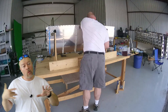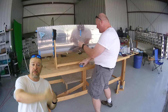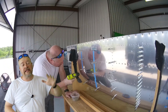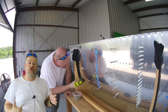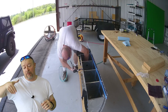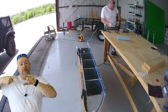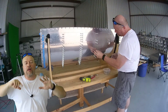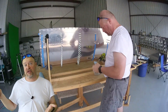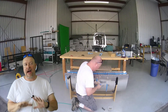Something you're going to see me do is use the drill. After I've put the smear of ProSeal on the inside and put the rib back down into place, you'll see me go back to the drill. I'm not drilling out the hole — these holes have already been drilled. What I'm doing is putting the drill in reverse, putting it in there and actually pulling some of the ProSeal out through the hole. Works really well. It also makes sure things are lined up. There's no cutting going on because the drill bit is dull and it's going backwards.